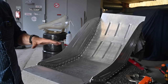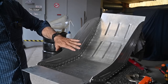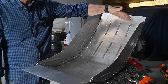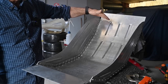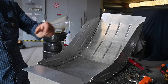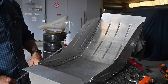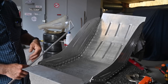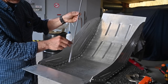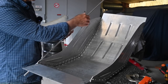There's still a couple of things we need to do on this seat. We have very sharp edges which we need to avoid — we cannot have edges that you can cut yourself on. In the front we need to bend the edge down and protect it, and on the top there's a piece still sticking out that will have to bend backwards once we have the back support done. We still need to make the holes for the seat belts and for the leg support straps. To protect the edges I'm going to use an aluminum tube, cut open on one side with a thin disc, so I can slide it over the edge and bend it to the shape.